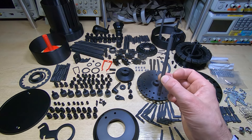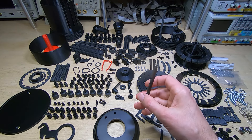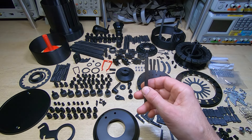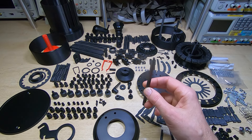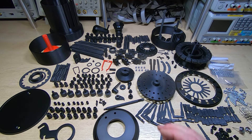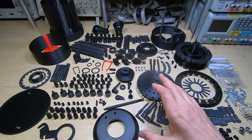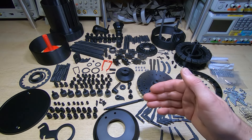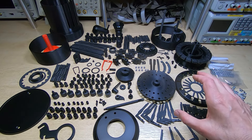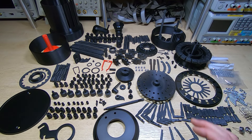He's struck a fantastic balance between the amount of work required to finish a part and the printed size. What I've done on some parts is expand them in the X and Y scale by 0.1–0.2%, which allows me to take off more material and still end up with a part that's the right size. However, that extra 0.1–0.2% does make a lot more work — finishing alone has taken over 60 hours. Every single part pretty much needs to be hand finished: filed, sanded, and in some cases painted.